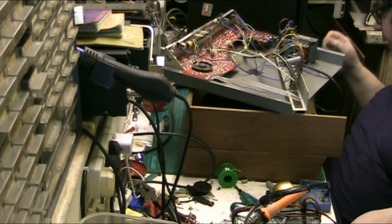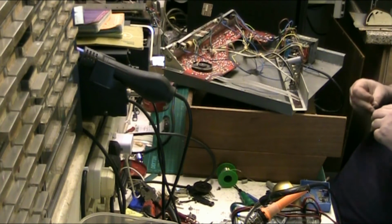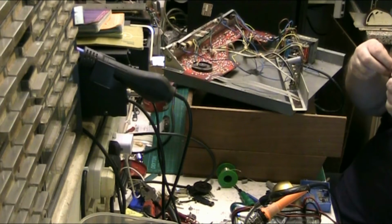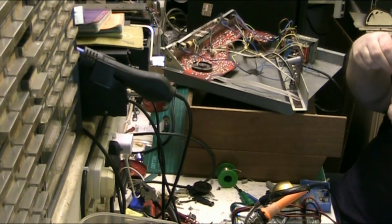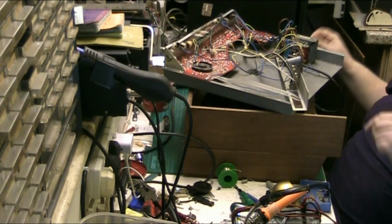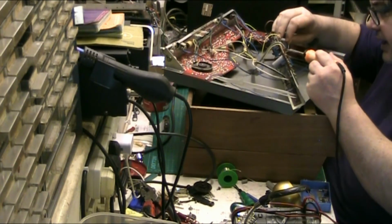Hi, folks, I'm back. Anyway, right, I've just taken this capacitor out. What they've done, the sneaky bastards, they've actually twisted the leads on the capacitor. So it makes you think that the positive is this side, negative is this side, because they've twisted the leads round. Very, very sneaky. Anyway, I did actually fit the capacitor, and I realised after fitting it that they'd switched the leads round, so basically it's fit it again.